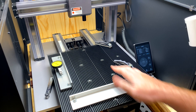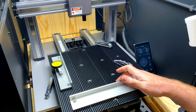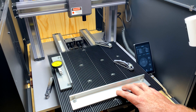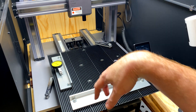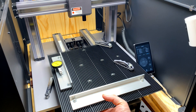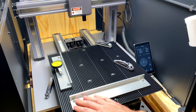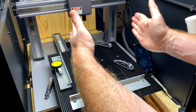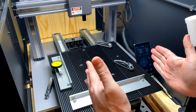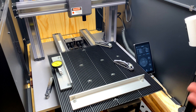What we have here are commonly known as fences - these are sort of hard stops for setting up and aligning your work pieces. They're bolted through to the normal holes that the bed would use, and that sets you in the ballpark of being square with each axis because those bolt holes are already factory, so it gets you pretty close to where you need to be.